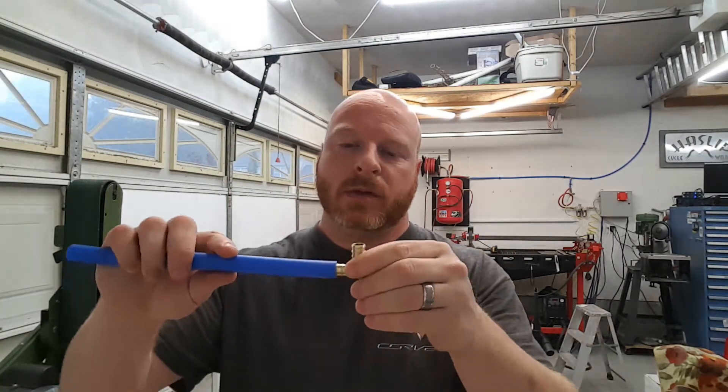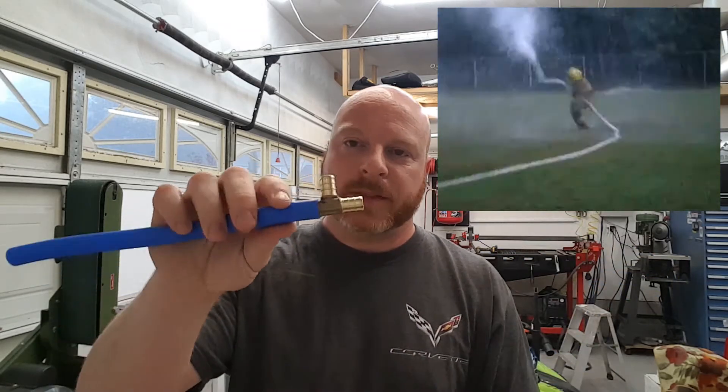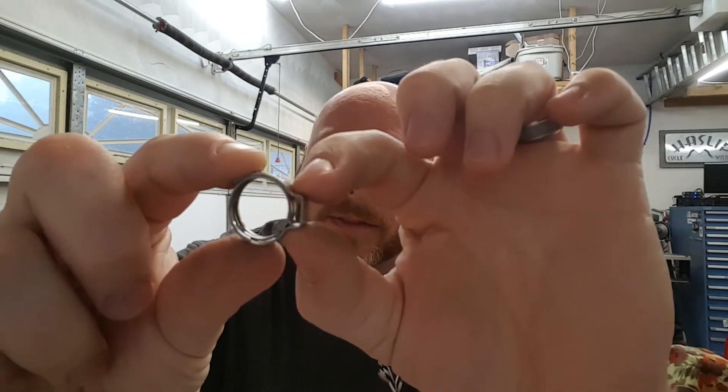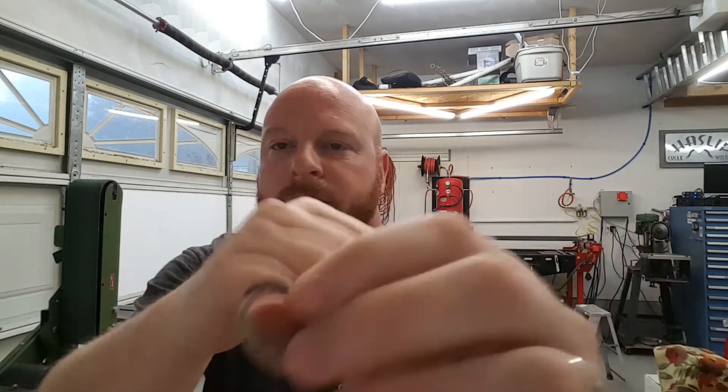Cut your fitting — see how easy that went on? Very low resistance. But you put one or two PSI in that and that fitting is going to come off. So there's a clamping means of installing this. Half inch line, half inch clamps. There is a tool — what it does is it clamps on here and squeezes and compresses it. There are some little keys on it so you can remove these once they are compressed if you need to make a change.